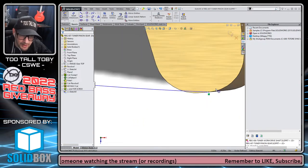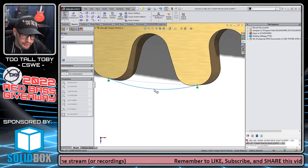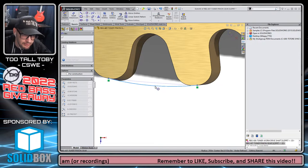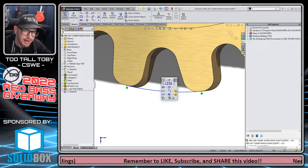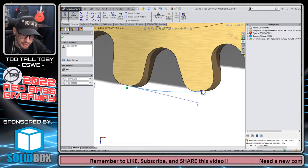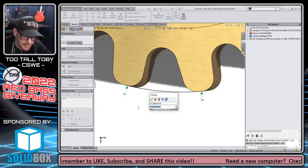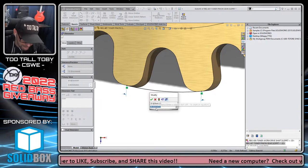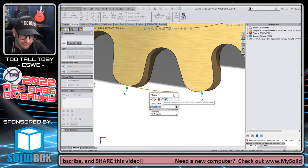And then I made that arc either co-radial or just closely lined it up to what we're seeing on the gear itself. Then I did Smart Dimension and I picked the arc, the end point of the arc, and the other end point of the arc. And that gives me a dimension of 0.0835.